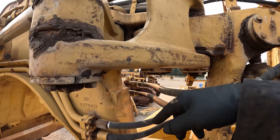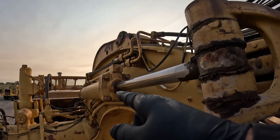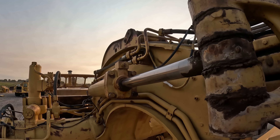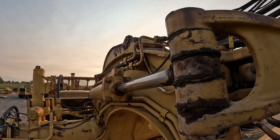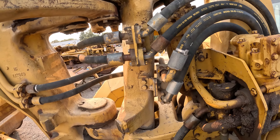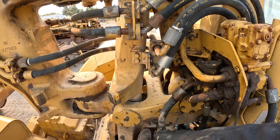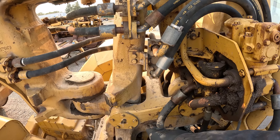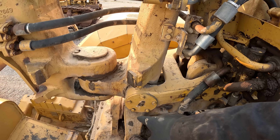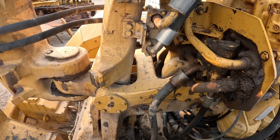You've got your H-link there and then your main kingpins — you gotta grease one on top. All these steering linkages: we've converted the rear steering cylinders over to be greasable. Originally they weren't on these when they came out, but with the D models they started making it so you can grease those back ones. You've got your two main kingpins down there, so we've welded plates on them. This is the only one I don't have hoses for — I just need to undo those two fittings on the bottom and screw hoses in so you don't have to crawl in there to grease those.